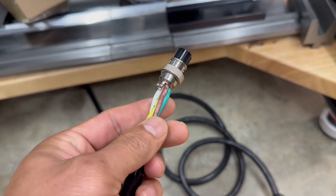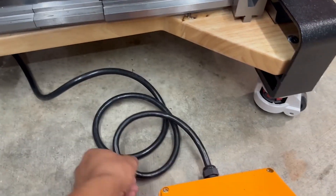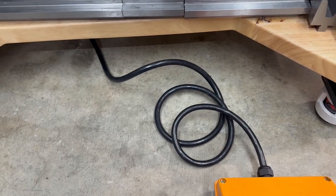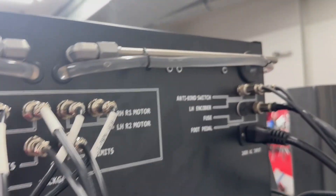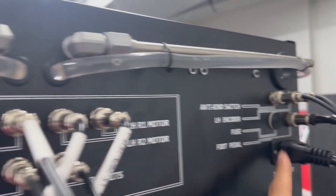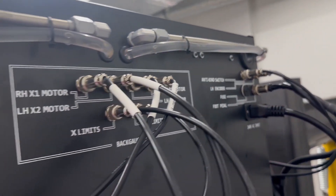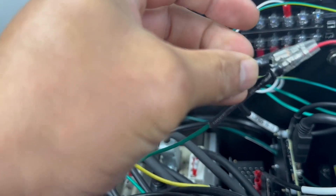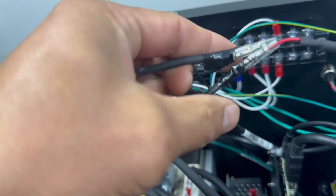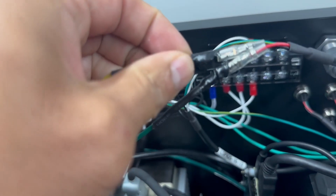I would recommend something lighter gauge — maybe 22 gauge or something like that. You really don't need heavy-duty wire; I'm not dragging this all the way around my shop, and with a kick pedal you don't have to worry about anything dropping onto that wire. You can see how thick this cable is in reference to some of the other connectors. I would have just picked something in between to make it look more clean — but this still works, it's not a problem. Another thing I would have done differently was use heat shrink for the connectors I added. Right now I just used electrical tape, but I would have used something to match the other connector there — they use clear heat shrink here, so I would have used something similar.